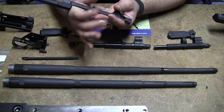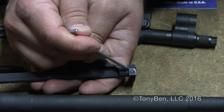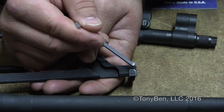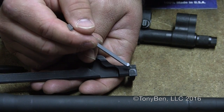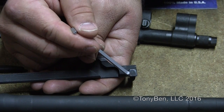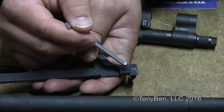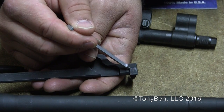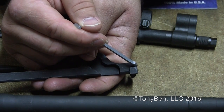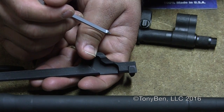One of the features I really wanted to show you: I noticed one of the first things that I do for an operating rod to get it to fit right is I round off the corners right here so that it actually fits into the dismount notch on the receiver. Every other one I've ever seen that was brand new was perfectly square and it was a booger to get it in and out. What I ended up doing to make things easier is slightly stone off the corners. Well, he's already done that. These operating rods are already finished with a slightly radiused corner to assist in the ease of installation and removal.